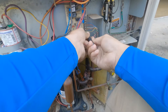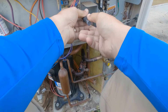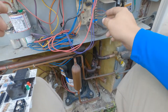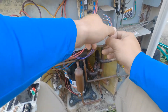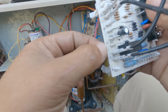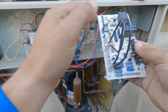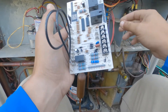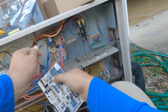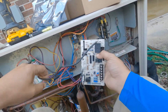First things first, I'm going to get the low voltage unhooked. These are going to be going back on the same spot. A lot of the other things are going into a different spot but with the same meaning — mainly the same markings. You'll see Y1 out, common on here — you'll have a Y1 out, common. The high pressure switch may just be in a different spot, so you've got to pay attention. You can't just start unplugging and plugging. What I've always done is unplug one wire and put it back where it's supposed to go. So we've got our fan wire — that goes to our condenser fan motor.